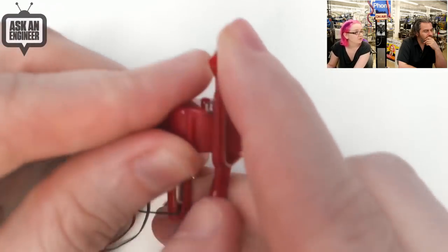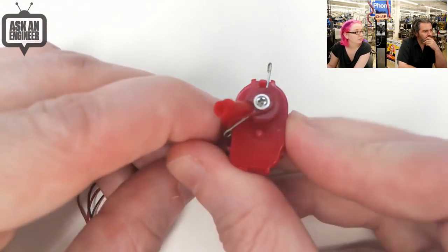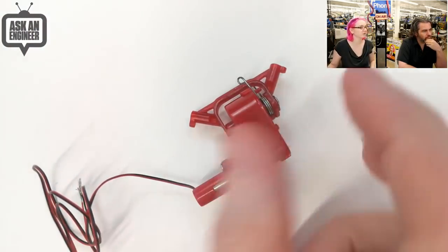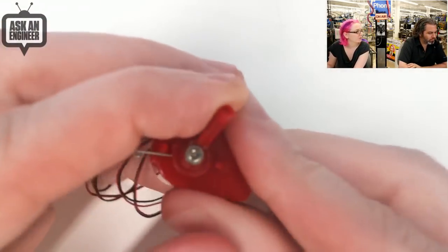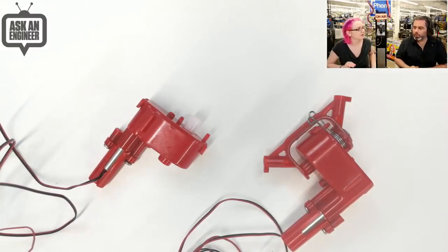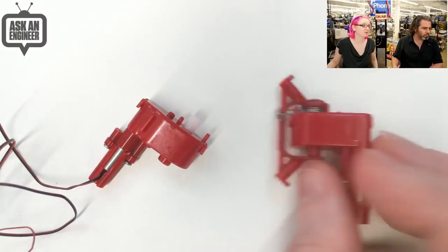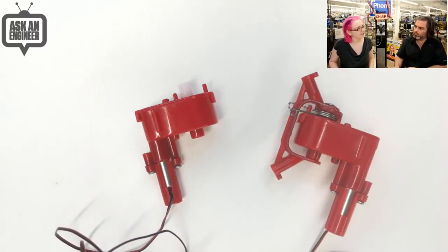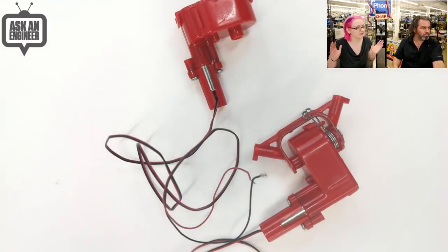It's designed so that even if you're driving it at 3 volts, you don't want to do it forever, but if you drive it it will stop at the limit and it won't damage itself — it'll stall but won't melt. So it's kind of interesting to use if there's something where you'd normally use a servo but want something lower cost, or you just want it to move back and forth, or you want something with pretty high torque, or a very small rotating thing. For puppetry, for all sorts of organic, for art projects this is really good. It's extremely small compared to most motors — a very tiny little device with low current draw.